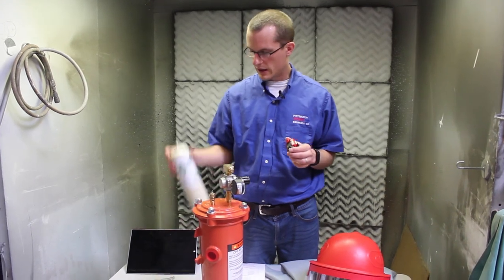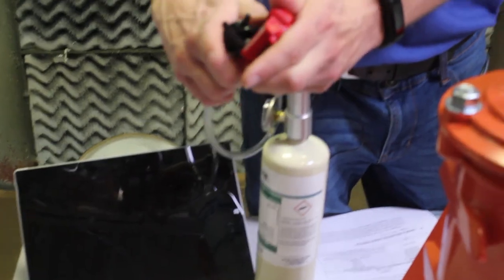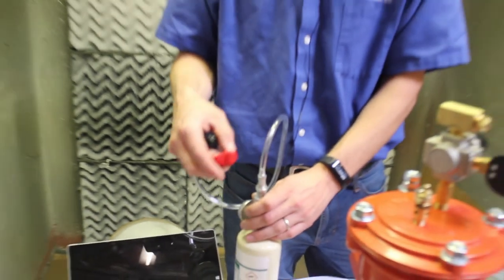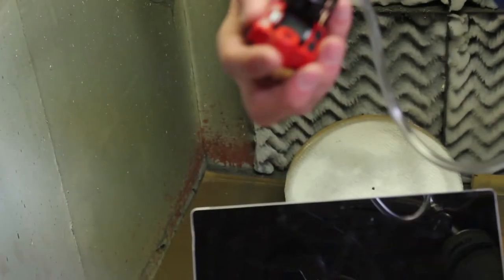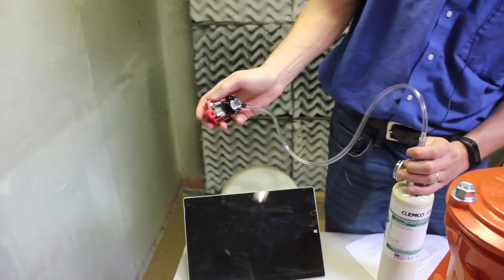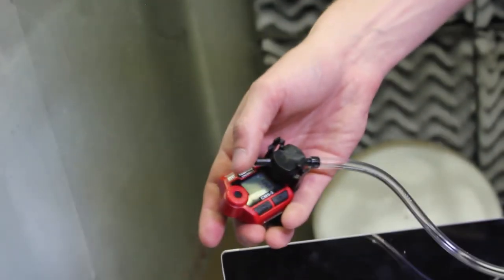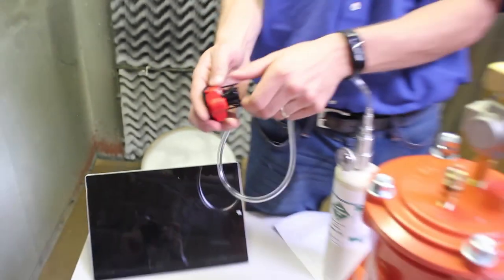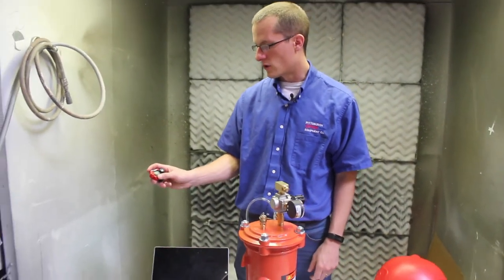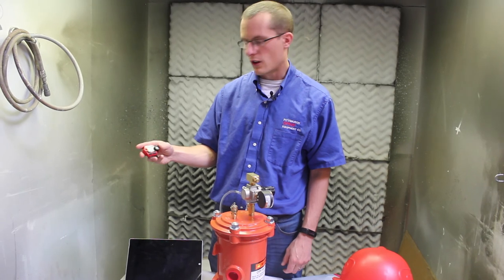It's battery operated, and the calibration kit comes as you see here. Calibration gas connects to the unit, then you open the gas — I'll show you what it looks like when it's alarming so you understand that. Turning it on, you see it turns on as expected, and now we're monitoring for CO. I'm going to turn on the gas to simulate a false positive here. At 10 parts per million, which is the OSHA maximum allowable CO in breathing air, this unit will alarm, notifying the operator to leave the area and identify the source. When I remove it you can see it counting down to zero as there's no more CO present, and then you can turn off the alarm.